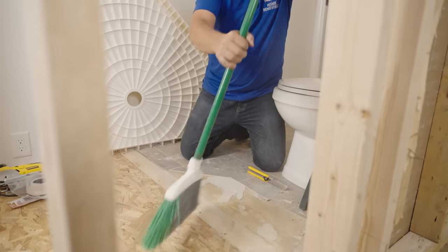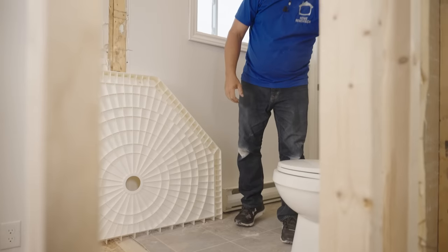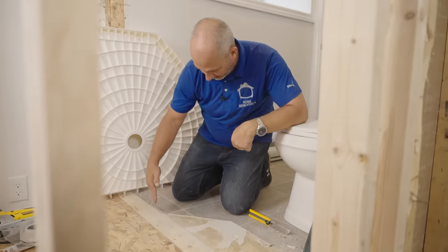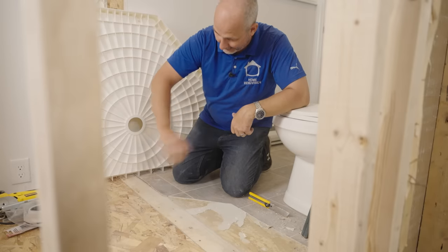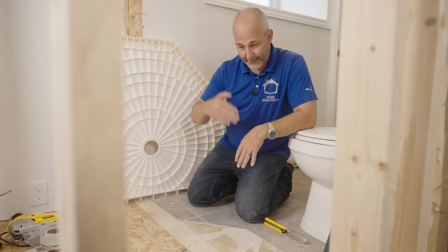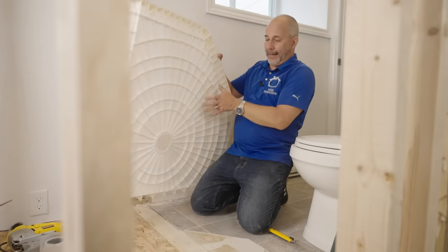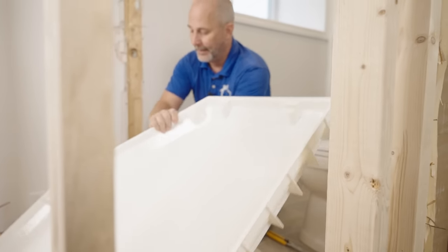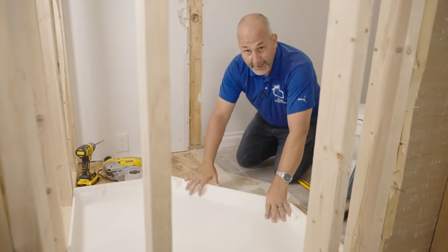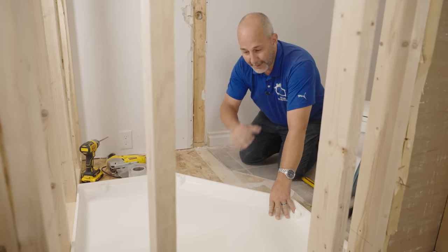In this situation I'm actually adding more space to the room. If you haven't seen the first video, please do. This is the end wall of the original bathroom — this is all an extension. No matter how hard you try when you're building and adding another floor, you're not going to get it perfectly level, which means we're going to have to install this pan into something we can level it into and let it dry overnight.